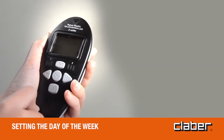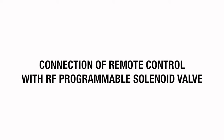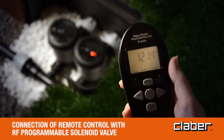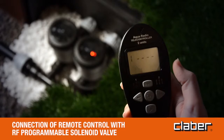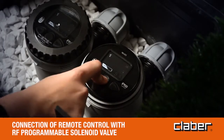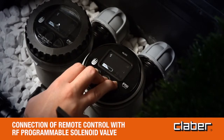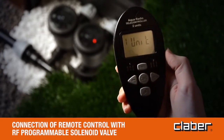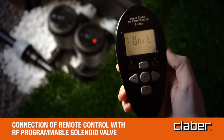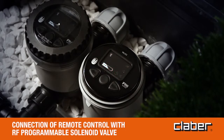To confirm and quit, press OK — the main screen will appear with the current time and day blinking. Connection of remote control with RF programmable solenoid valve: on the radio remote control, select the unit to be connected — in this instance, one or two. After selecting the unit, for example one, the LEDs will blink in red. Press any button on the valve to light up the display. Press the three buttons of the valve simultaneously until they blink in red, initiating clock transmission. While the valve display keeps blinking, press the hidden button on the radio remote control with the tip of a paper clip. The display will start to blink and the symbol RF will appear. The connection will be successfully completed when the message 'unit' appears on the remote control and the valve starts an initialization cycle — LEDs light up in sequence, valves close in sequence.